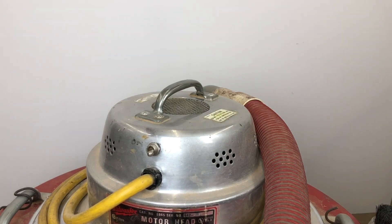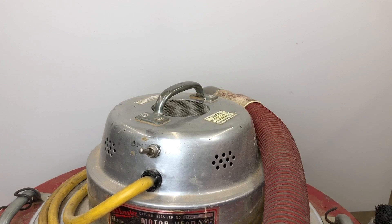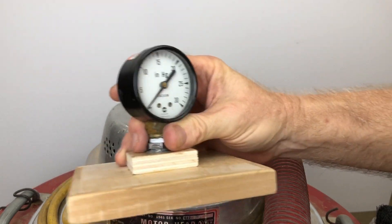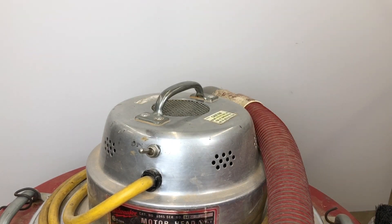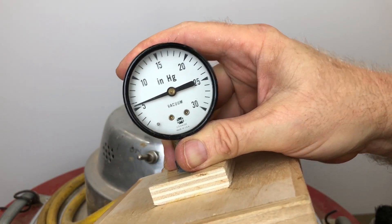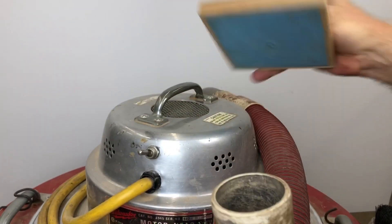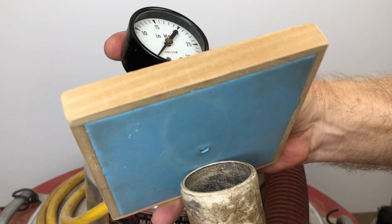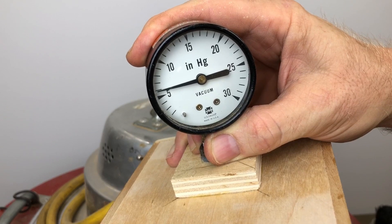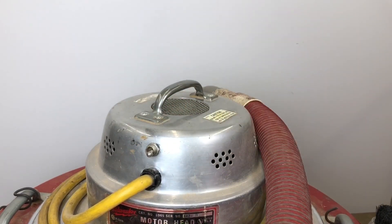It was a tragic, comical, and very disheartening dismal failure. I'll show you why — I turned the thing on and rigged up this little object here. It's just a rubber gasket, a rubber surface with a vacuum gauge attached to it, so I can test the vacuum pull of these various machines. Here goes my beautiful shop vac — she's pulling a fantastic vacuum, ripping right along. She tops out at just about six inches of mercury. That is nowhere near adequate for the job.